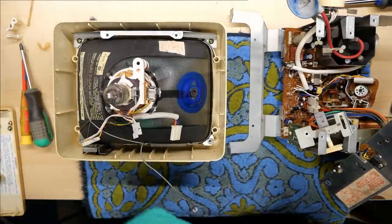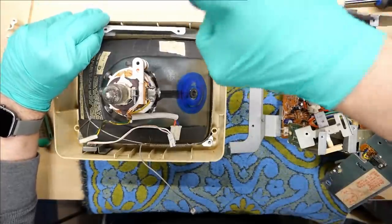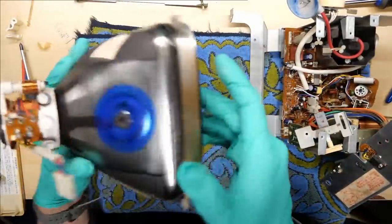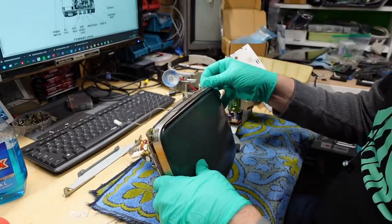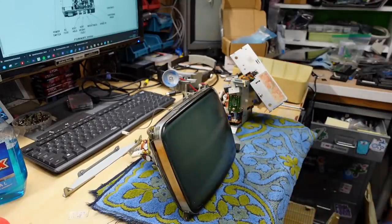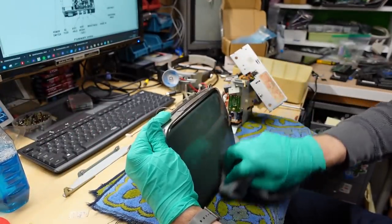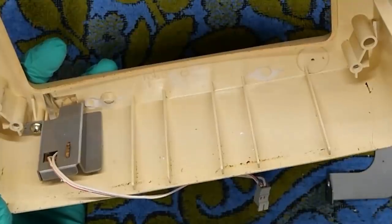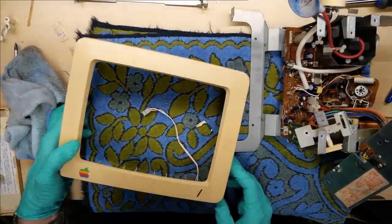So it's kind of unfortunate, but that's just the way it is. I'm just going to pop out the CRT while I'm at it. Might as well, since I'm basically there, and I'll give it a nice clean. See on the front of the CRT, there's a nice ring of schmutz there. That's just not cleanable when you have it mounted in the chassis. So it's good if you can, while you have it out, give the front a nice clean. We can see where the plastic snapped off the front bezel, probably when this thing was dropped. Luckily, it didn't break anything on the front side — it's just on the inside, and those are probably completely fine broken bits.